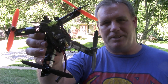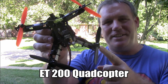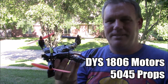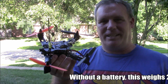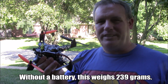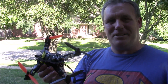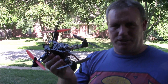If you're looking for a quadcopter in a 200 size frame, I suggest this one. This is a Diatone ET200 quadcopter with 1806 motors and 5045 propellers. I've been flying my Diatone Blade 150 for a long time and really liked it — it's a solid flyer — but after flying 250 size and going down to the 150, it just doesn't have the speed and agility that the bigger ones offer.